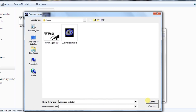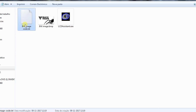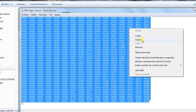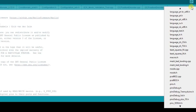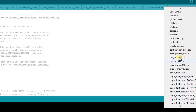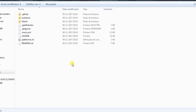And we are almost there. Open the file with a text editor and select all the data inside the curved brackets. With all that in memory, open the firmware using the Arduino software and look for the boot screen tab. If you don't have this tab, just use the link in the description, download it, and place it together with all the other files in the firmware folder.